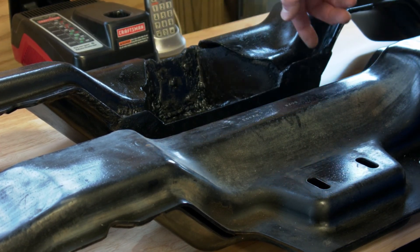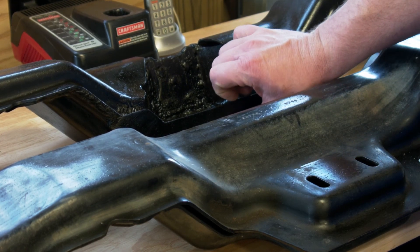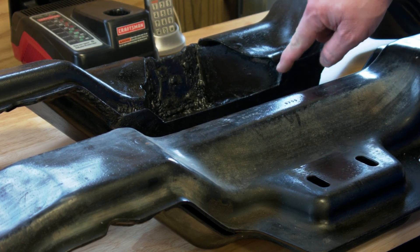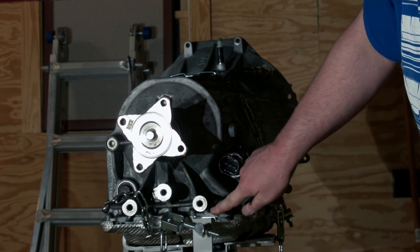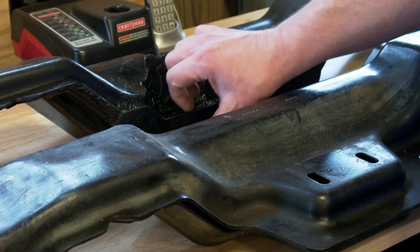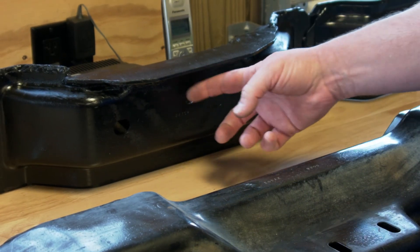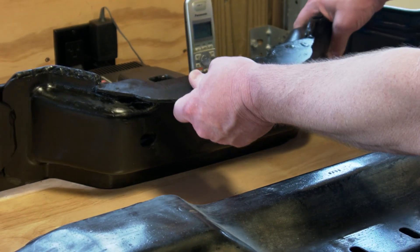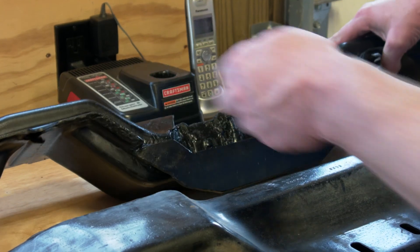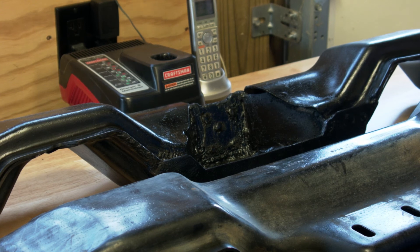We made the plate as large as possible — it was a three-inch piece — and cut a V-shaped notch in it to clear the mounting bosses on the transmission. We made it as low as we could without causing ground clearance problems. There will be a nut sticking down too, so hopefully we won't need to shorten it further, but we wanted maximum rigidity. This was a good compromise that preserved the integrity of the crossmember while giving us the clearance we need.